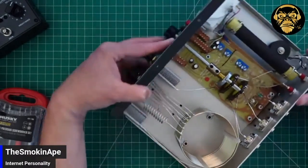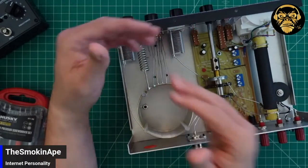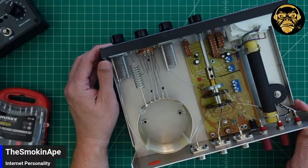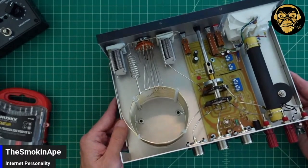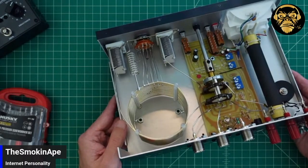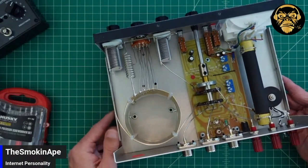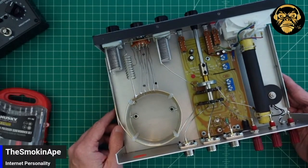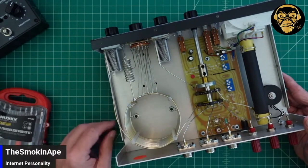So let me flip it around. The T goes like this and like that — that would be your T that goes on there. So on that knob, as you add inductance, you're moving down that coil from top to bottom. Correct. And I'll point out that it's grounded into the frame and also into the box — just like that, right here on either side.